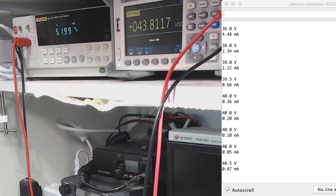Let's go up to 50 volts - you can see it charging, you can see the current going in. This is the information I'm trying to get from the leakage tester, so that part is actually functioning. At 60 volts again, what you see on the screen is what's on here. Within reason it's not 100% accurate but it's pretty close. There are some slight discrepancies but it's only resolution issues.